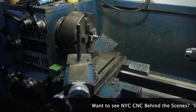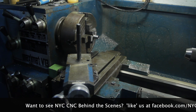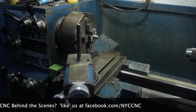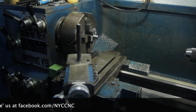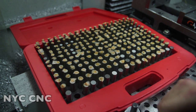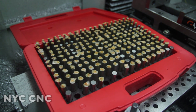Now, we drilled with a 484 drill bit, or 31/64. Drill bits don't drill good holes. They're usually not round, and they're usually not accurate, even in a rigid setup like this lathe. That's okay, that's what drill bits are really meant to do, and that's why we ream or bore or do some other finishing operation. Nevertheless, let's grab our pin gauges here and pick out a few. Let's do 484, 488, and 490, and let's walk over to the lathe and see what we get.